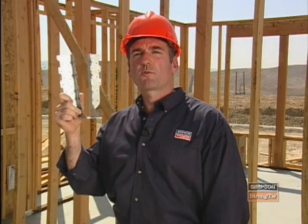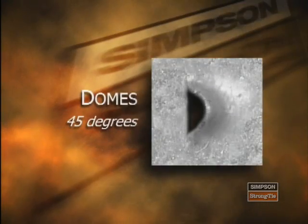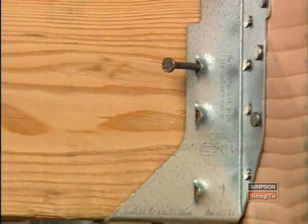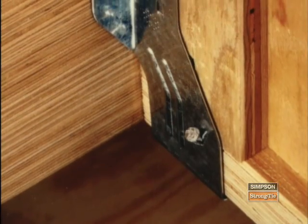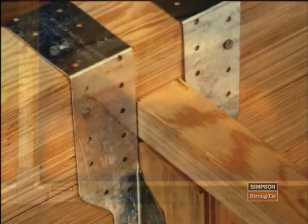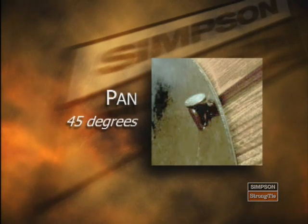Along with different hole shapes, Strong-Tie connectors use a variety of innovative design features to help secure their connectors with greater efficiency and more precision. The most common of these are the patented tabs and domes. Both of these features force the nail at a 45-degree angle, providing correct installation of our double-shear nail design and allowing for a much simpler, faster, and stronger hanger installation. Simpson also uses this 45-degree feature with engineered wood product connectors, commonly known as I-joist hangers. This application is referred to as PAN, or positive angle nailing, which actually forces the nail into the wood at a 45-degree angle, minimizing wood splitting problems.